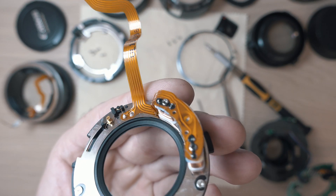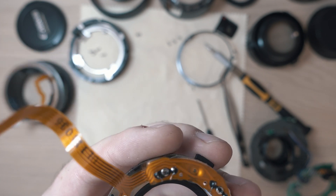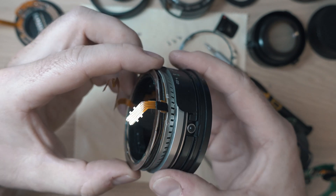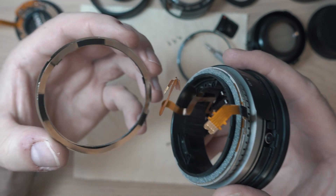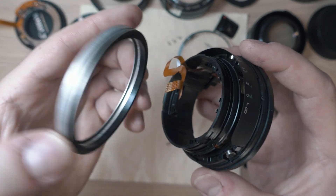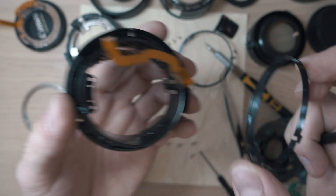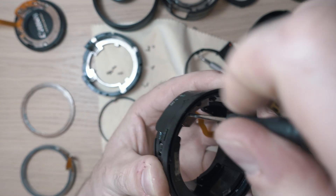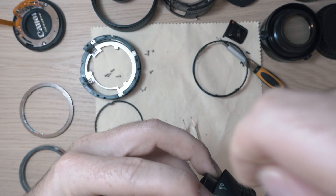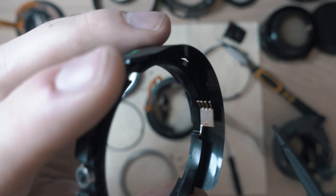The iris mechanism is delicate and it's better to check those four tiny wires. This can be disconnected by unlocking the rear washer with a spring washer on it. This is the motor part, followed by this ring. The next step is to unlock the plastic ring and unscrew the steel connecting part. Unscrew the hidden screw holding the delicate terminals and lift it so it can be removed without damaging them. Here you can see how tiny they are.